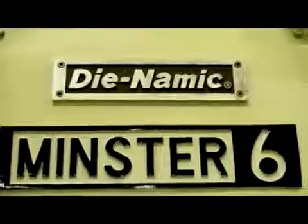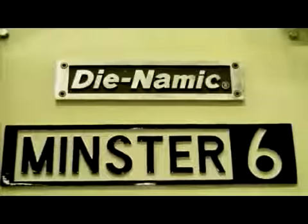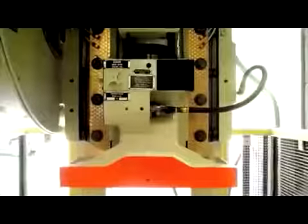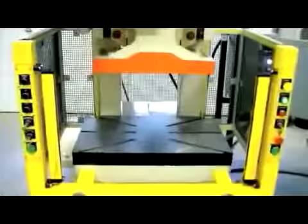Here's how the system works. Swift Trip is a press operating system designed with productivity in mind. An operator simply deposits the part in the die and withdraws, passing his hand over the Swift Trip sensor, which is placed outside the light barrier. The press will only cycle if satisfied that the hands are out of the die area. It will not wait for any additional time-consuming decisions to cycle the press. This concept has been proven to yield extremely beneficial results.